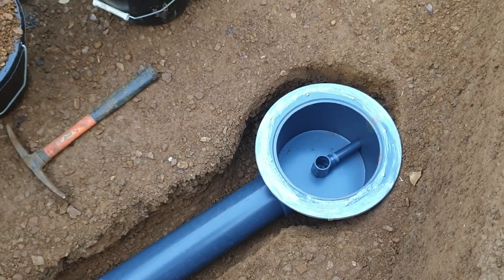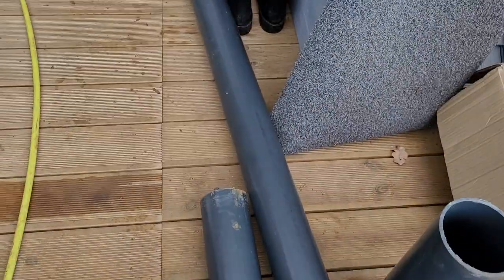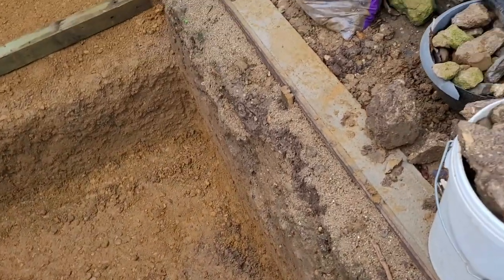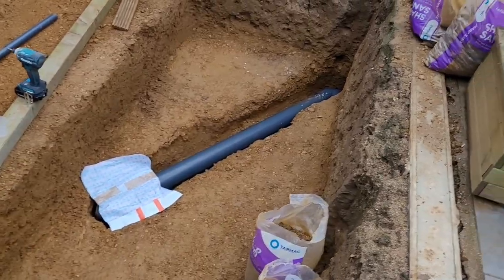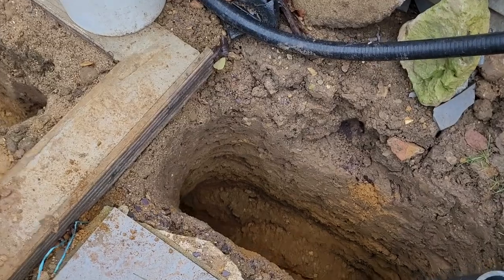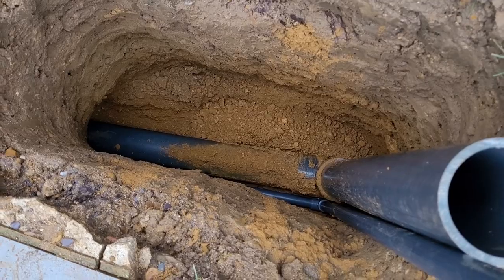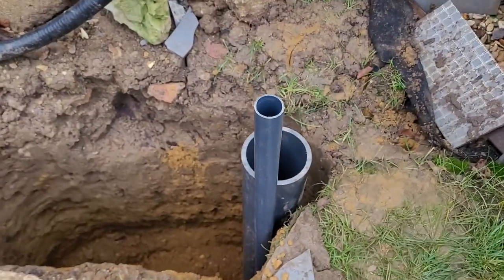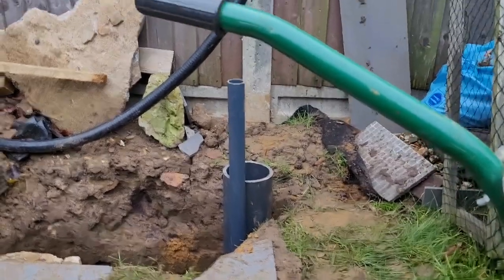It was now time to start working on the bottom drain. It's just dry-fitted at the minute, so I'm gluing it up now, putting the airline in, making sure the hole is big enough for the airline. This is a David Coastal Koi bottom drain — the airline comes in at the back. I've widened the trench ready to go. The bottom drain now fits in, and I've dug the pit on the other side for it to come out. Gluing up day — getting the bottom drain all glued in. It's gone all the way through and up; I chucked in a tiny bit of soil because I'd dug the hole slightly too deep — needed to be about three foot nine or ten — to make sure everything is perfectly plumb, level, and coming up at a right angle.